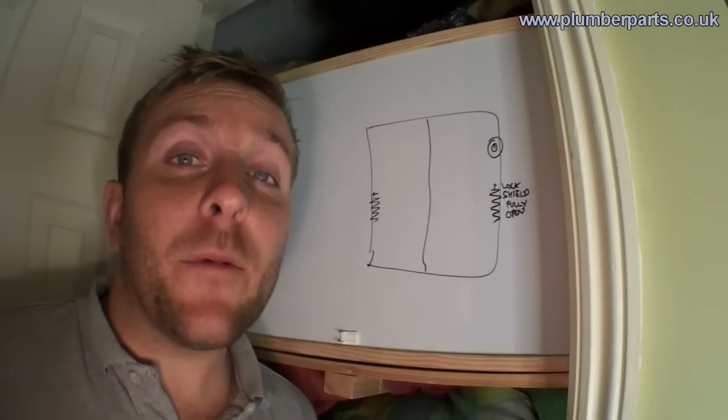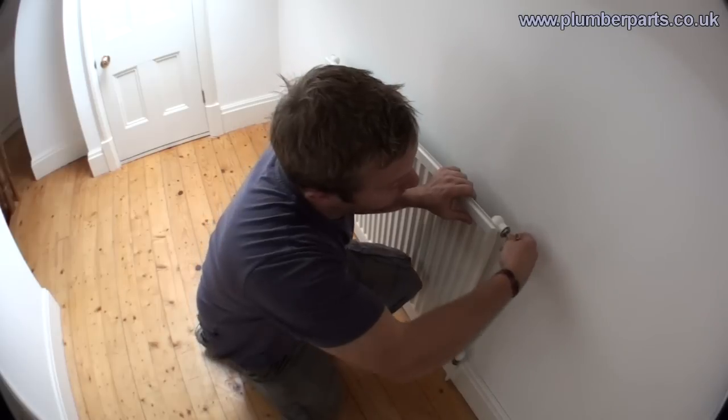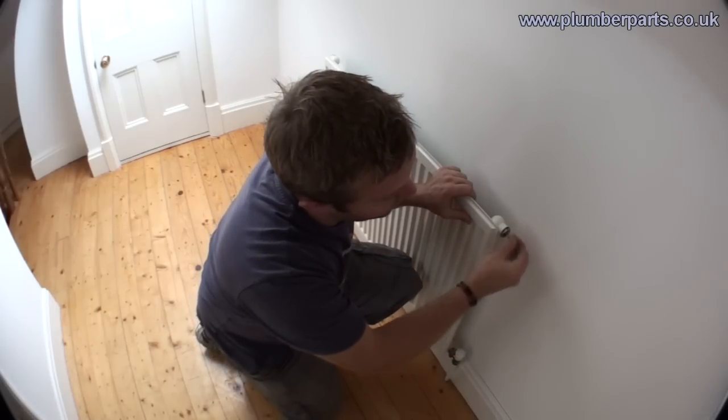So let's go back to the house and find out how you actually change a lock shield over for a TRV and really how easy they are to install. I'm assuming you all know how to drain down the heating system already — finding the lowest point in the heating system and drain off, taking your hose outside and opening that up and making sure the water supply is turned off to the heating system. Next, you allow air into all the radiators that you want to change the TRVs on. Let air into every radiator in the house. You should hear the air sucking. As soon as you see your hose outside stop running, that should indicate that the heating system is drained down and you're ready to change the valve.